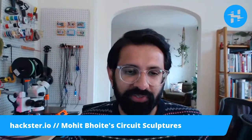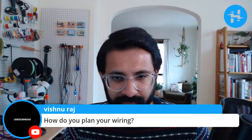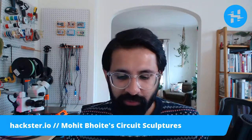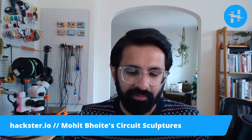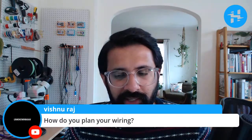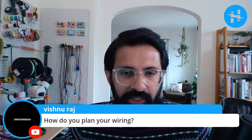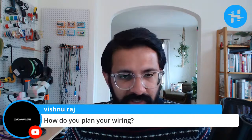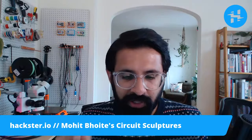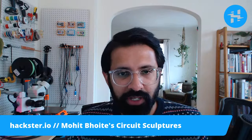You know, it's fun. We have a question about how do you plan your wiring? So do you make sketches and stuff beforehand? I do, yeah. I will make rough sketches in a notebook by hand, and then if it requires precision planning, I will literally draw it in a CAD program like Eagle, a PCB designer. I will draw it as if it was a circuit board, because that gives me control over the width of the wire, the distance, the spacing, and I can print it out